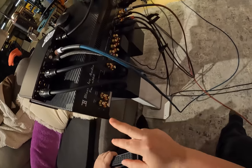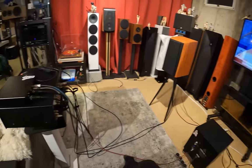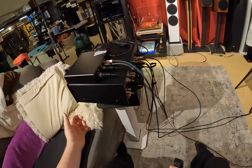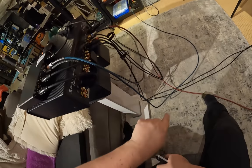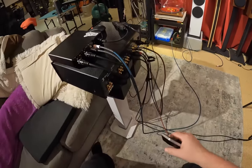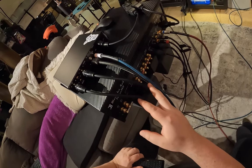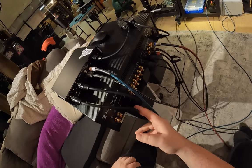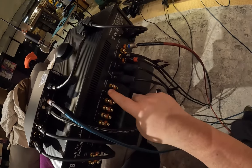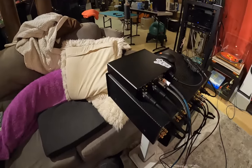From left to right: record in and out — this is a feature that isn't used a lot. A lot of recording, as it actually says on the webpage, it's for vintage or anyone using slightly older record loops. Where if you flip the switch, no sound comes out of your setup — but it's actually running through and supposed to run back into your setup. So record loops in and out. You get your signal in, and input one is shared as an RCA or an XLR — I don't believe you should use them both at the same time.